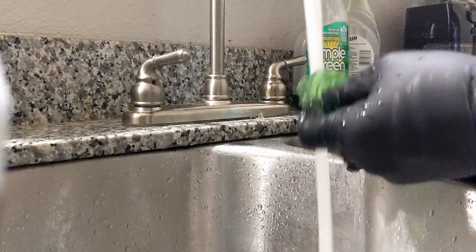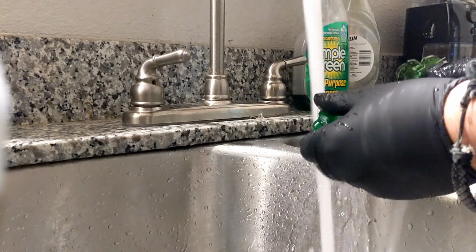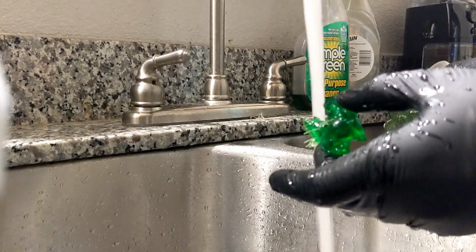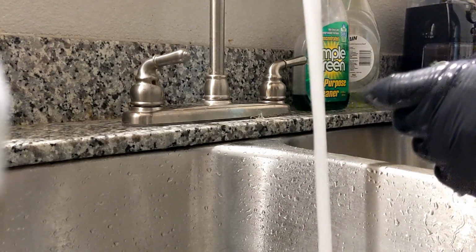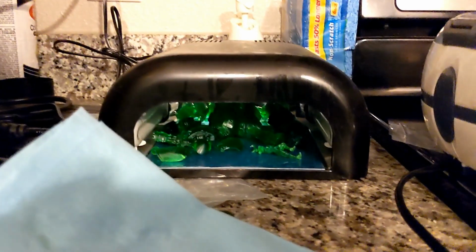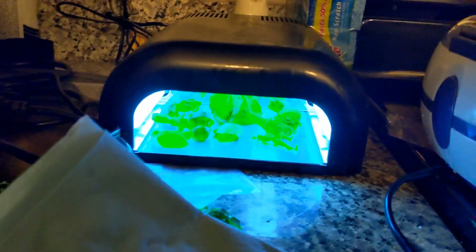It's also going to transfer that heat into the resin and make our supports very soft, making them very easy to remove. I find simply twisting the item around the axis that it's on, the support there will pop right off, and any remainders you can clip off. You can also clip them all off individually if you really want to make sure that everything is nice and simple, or if you have a very fragile piece.